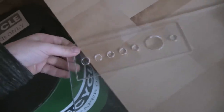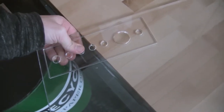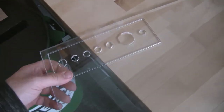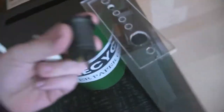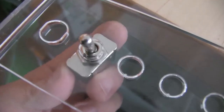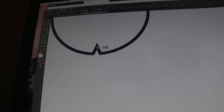This piece did not come out that great — it looks like it didn't cut all the way through. So I'm probably either going to have to increase the power, slow the speed, or maybe do two cuts at a faster speed. But I have two spots open so I can at least test the two pieces to see if they fit. This piece fits perfectly, and then I can see I need to make that little nipple a little bit bigger so this actually holds in place and doesn't twist around.